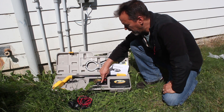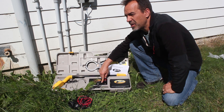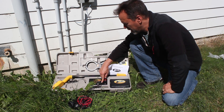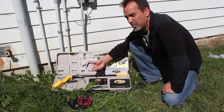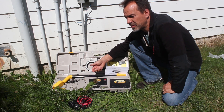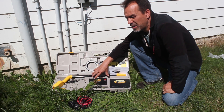The fourth LED on here is the transmit light. For lack of a better phrase, it's just telling you how much power you're putting out on the cable to be able to track it. The brighter that light blinks, the better your locate is going to be — the more current is flowing down that cable. If it's a weak light, you're not going to get a good locate.